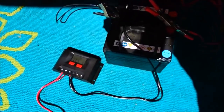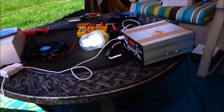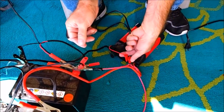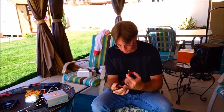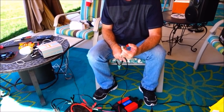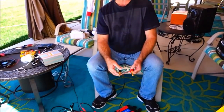Our voltage is still holding at 13.5 volts. We've got a light on, we're charging the phone, and now I'm inverting power. I've also hooked up an additional 12-volt source — these are just sitting here, but this becomes another 12-volt tap for something you might need to hook up. I hooked that up to the points where the DC is coming into the inverter, and it comes in handy if I need DC power quickly.